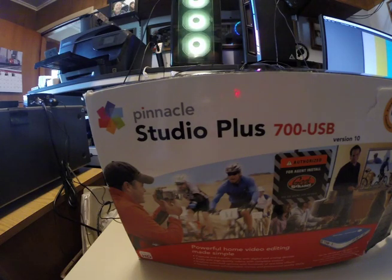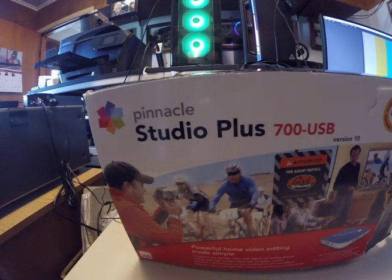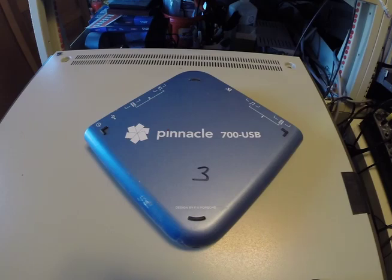Moving on from the videotape machine is our capture card. There's a lot of cheap capture cards out there for VHS, but we use this Pinnacle Studio capture card. It was one of the first ones that was ever really produced, and we use it primarily because it's built around the 720x480 format that VHS and U-Matic uses. The modern capture cards are all in a higher resolution, and they capture these old videos at a higher resolution — that really pronounces all the artifacts and flaws on the video — whereas if you capture it at its native state, the 720x480, you have much better picture quality.